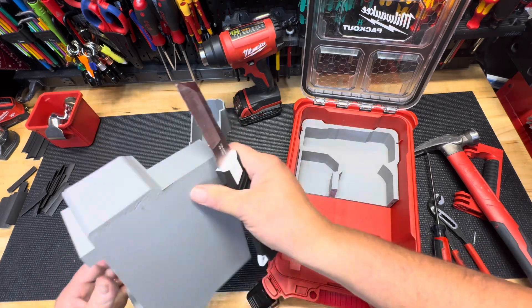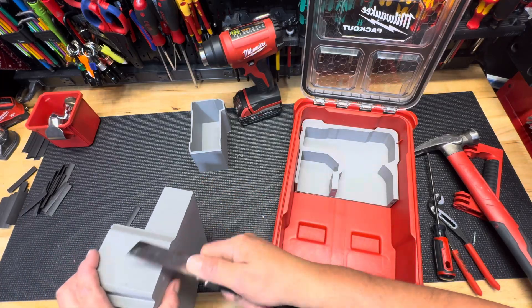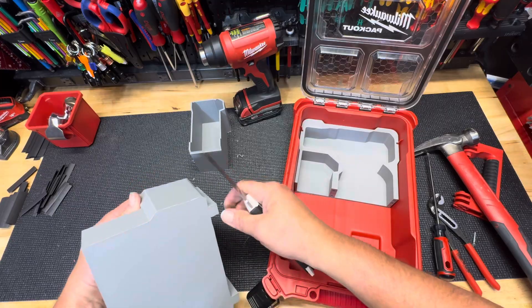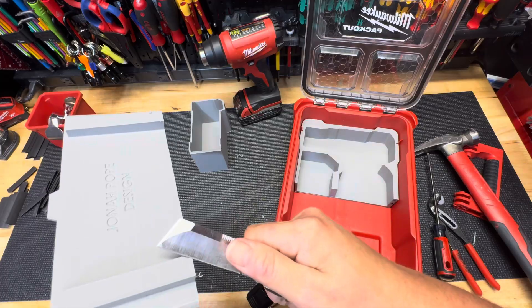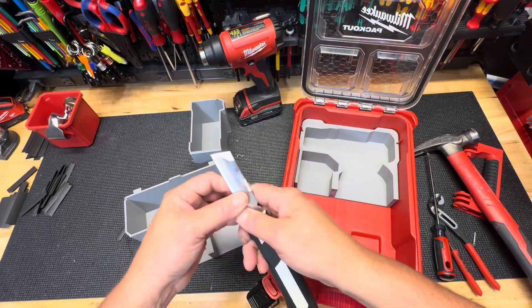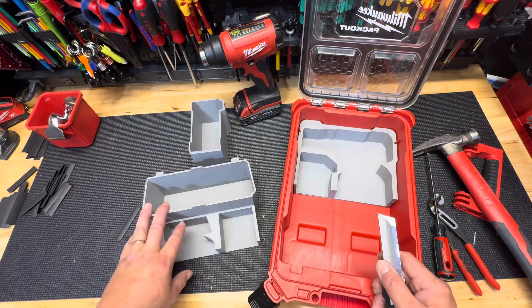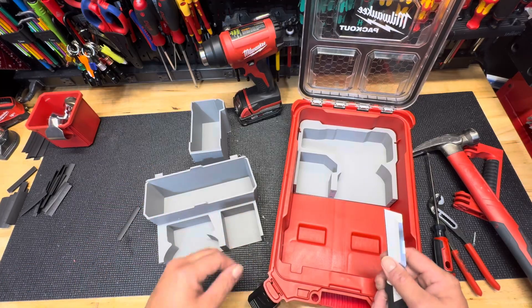You can also use a bit of heat on these. Obviously it's made by heat, so if you use a bit of heat it does smooth things out. This material I'm using is Hyper PLA, so it's not the most durable material. If you've got it in the heat or you're going to be using it in harsh conditions, you definitely want a harder material like PETG or something like that. However, for me, these guys stay pretty much in the AC 70-80% of the time, so they're not going to get used in extreme conditions.